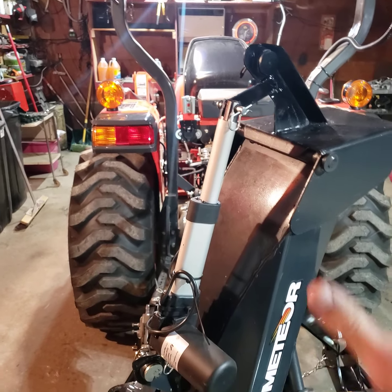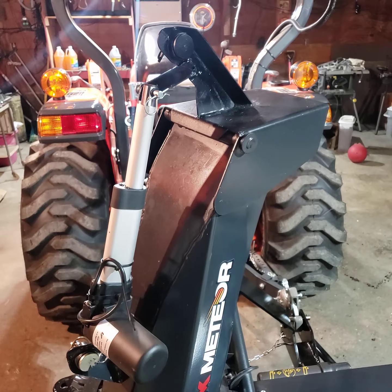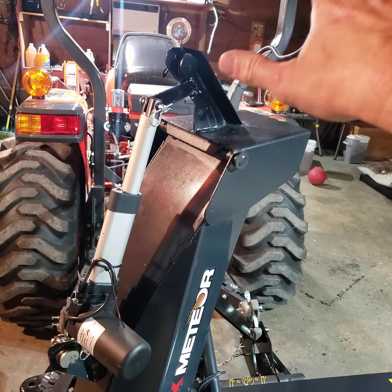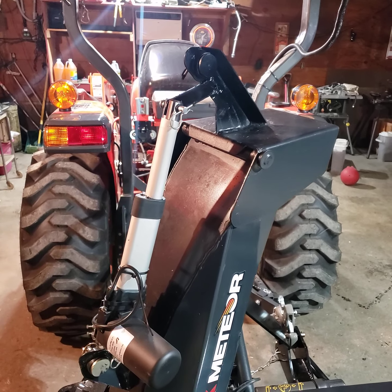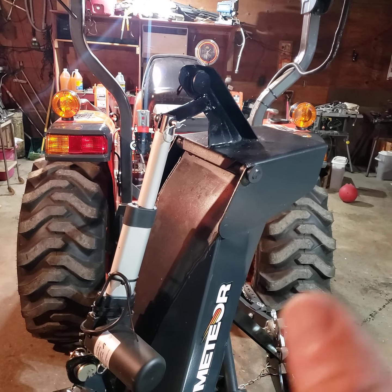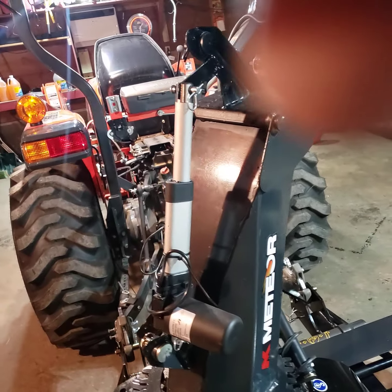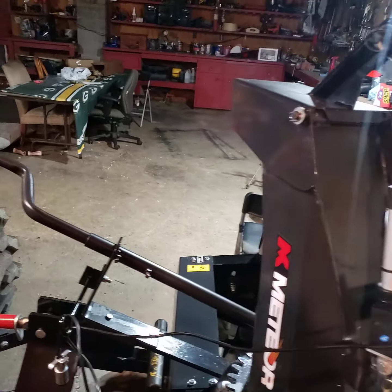But the big part for me, static, when it's sitting like this, flat with the snow coming out, hitting it the most force, it will hold 400 pounds. When it's in motion, so say like I'm shooting it far and I'm bringing it down to this, so you're going to get more and more resistance, it's still going to provide 200 pounds of resistance at 5-inch stroke with 0.75 of an inch per second. So it zips pretty good. It's not too fast. It's perfect, I think. I couldn't have been happier with it.